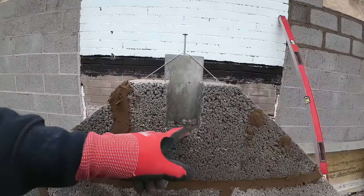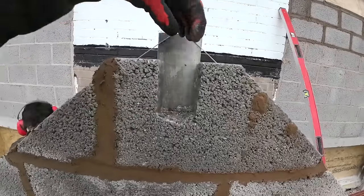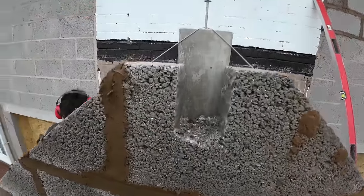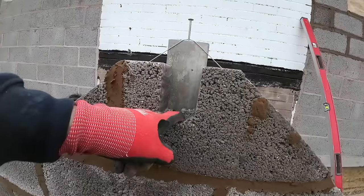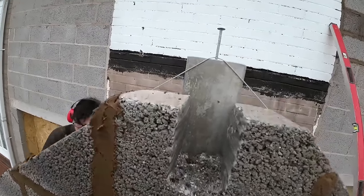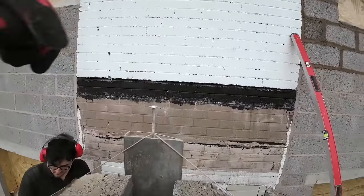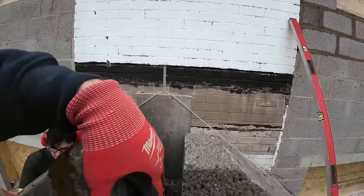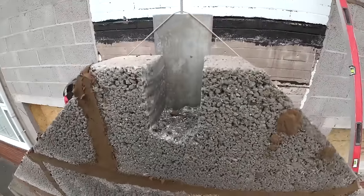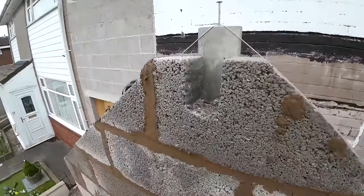We've cut a notch out for the ridge. Now the customer can put whatever size ridge he wants and wherever he wants, he can pack it across to the house. So that worked out well, because it's a nice solid piece for the ridge to go in. We just need to tell him to put a piece of timber on the wall, then screw a piece of timber to that, and then put a couple of grabbers into that just to brace the pike until the roof goes on.